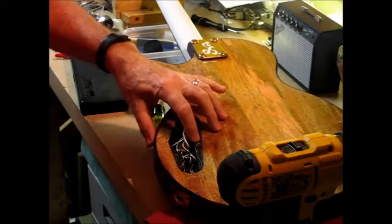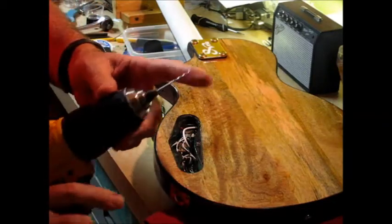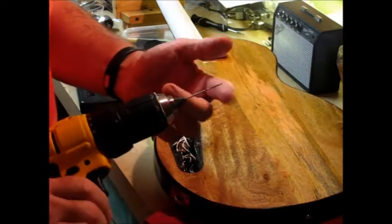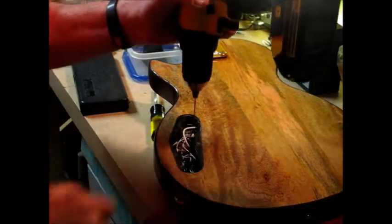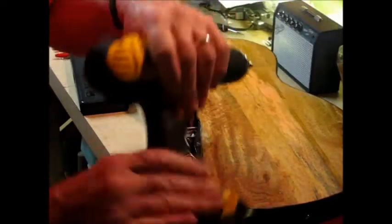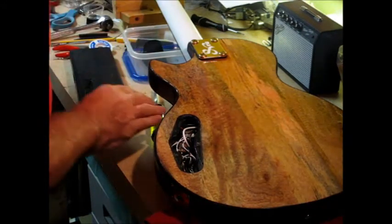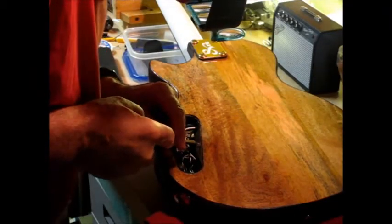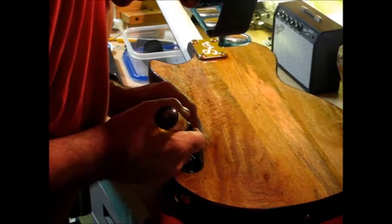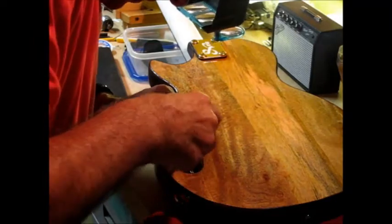My approach to get the broken screw out of this spot started with taking a small drill bit, 50 thousandths in diameter, a 16th, something like that, and drilling a constellation of holes around the broken off screw. My plan is next to take a small chisel and excavate just enough close into the remaining body of the screw to give myself a chance to get a purchase with a pair of pliers on it.